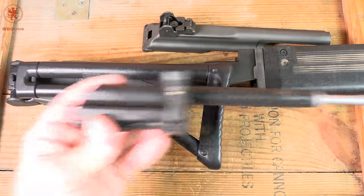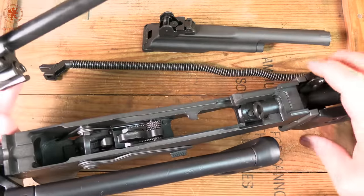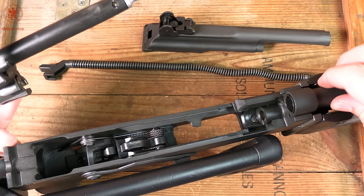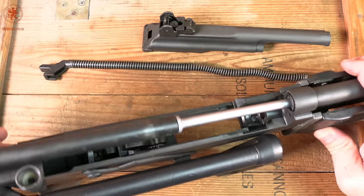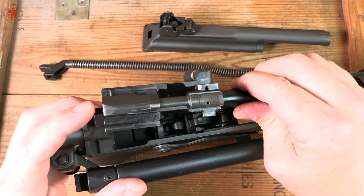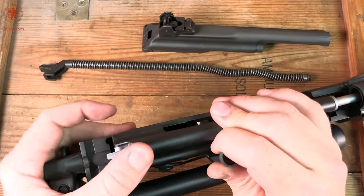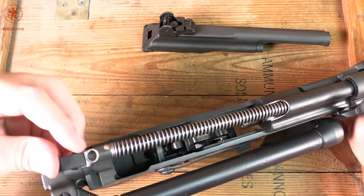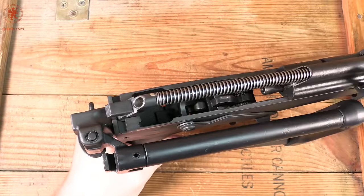Slam firing is when the sheer momentum of the mass moving forward causes the firing pin to keep moving and sometimes hit hard enough to set off a round — so always a positive to prevent that. I haven't seen many slam fires, but I understand enough to not want it to happen. To put everything back together, we go gas tube first, which fits nicely and tightly into this billet receiver. Then we get the piston going — sometimes it's easiest to start upside down. You want the tail of the bolt to be flush, then rotate it over and set it down, pushing down against the spring pressure on the hammer and sliding it forward. Next we put the recoil assembly back in, fitting it back into the grooves it came out of.